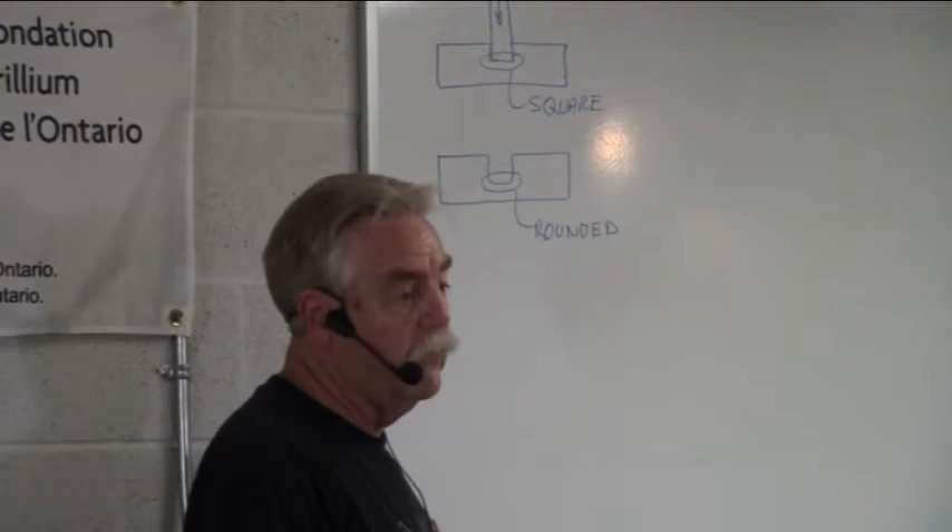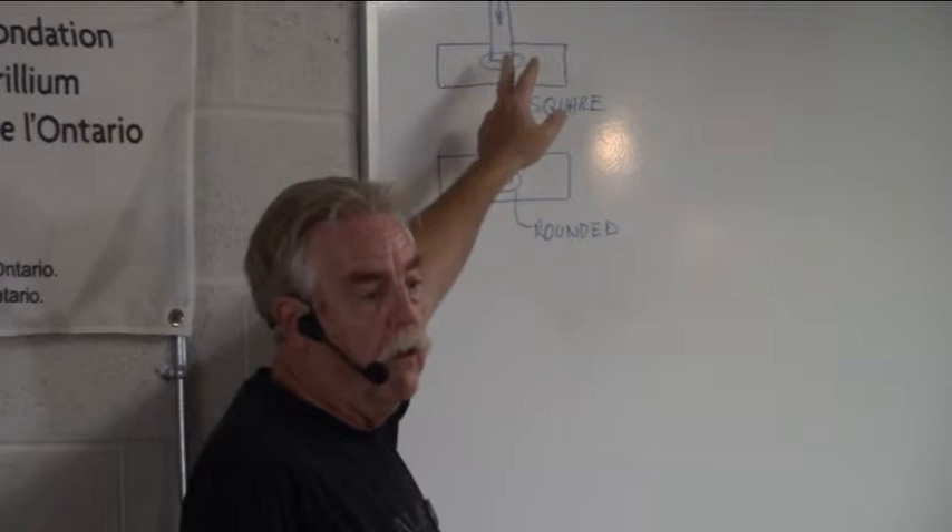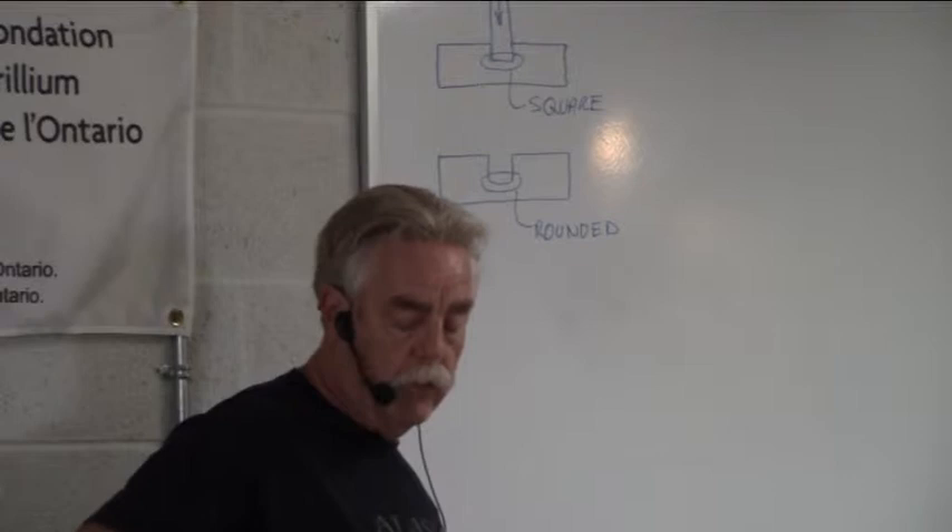The piece that's going around — you'll find one piece is very secure and very square. The other piece is a little wobbly, and that's because I made it deliberately a couple of thousandths wider than a perfect match.